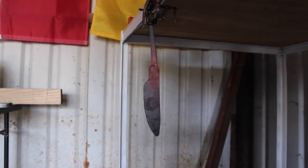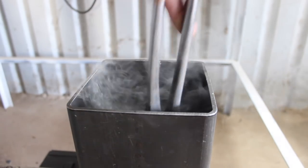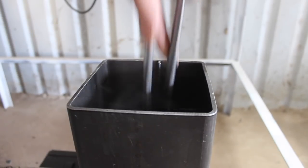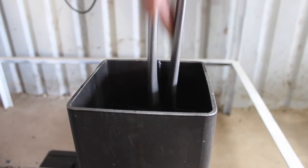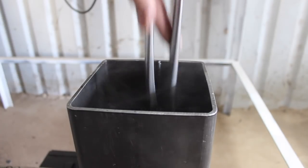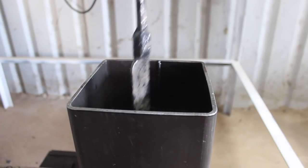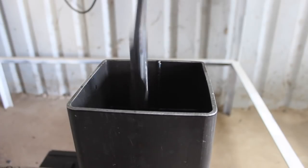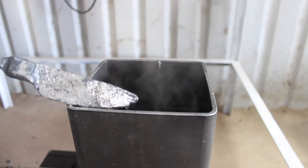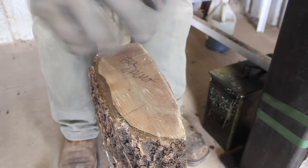The steel tells you when you need to put it back in the forge. I normalized it at 1625 degrees — this is a very important part of the process — and then did two thermocycles at 1500 and then 1450. It's important to hold the temperature on each of these processes for a period of time. I did 15 minutes, and you could go even 20 or 25 without really hurting the steel. That allows the components of the steel to go into solution; the chromium content in there kind of slows things down a little bit.